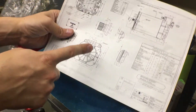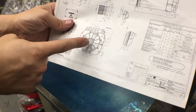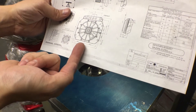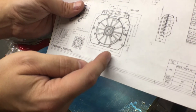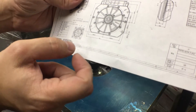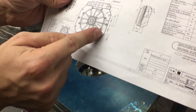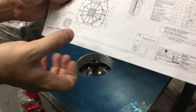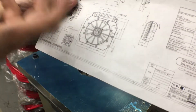The other measurements on here are just the distances between objects as they relate to the center. Here's how wide it is, here's the center, and the two pieces over here — this is 140 millimeters and that's another 140 millimeters. Pretty straightforward: it's the distance from the center of one hole to the center of another. The hole can be relatively as big or as little as you like, so long as it passes through the body of this aluminum plate and bolts up.